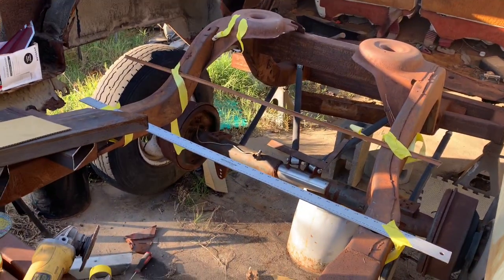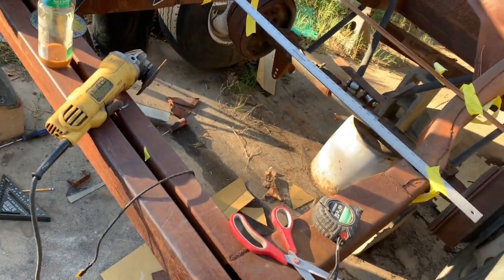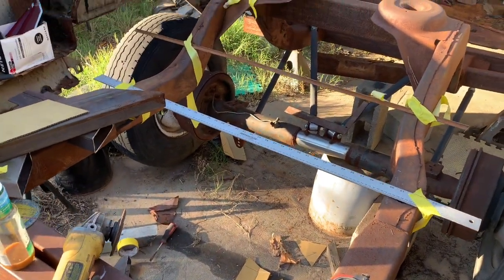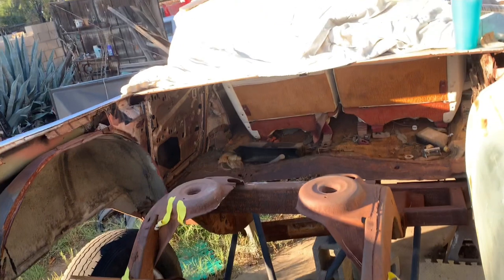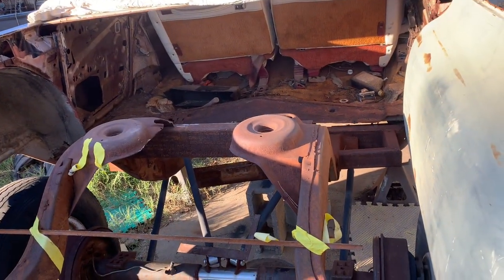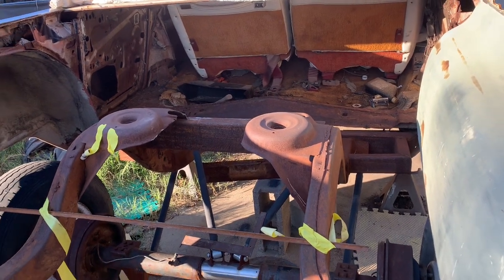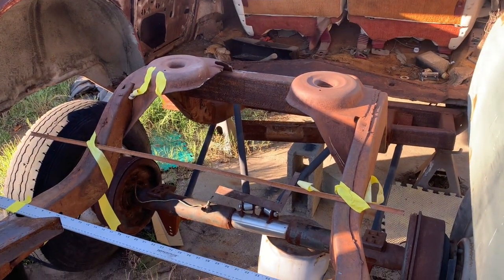So there's the back of the frame as it exists now. I already made it pretty stiff. It's got 2x4s in it. It's fully welded. I'm putting some torque boxes in the front there to give it some more strength. It's got some 4x4, goes up, connects to that 2x5 up in front. It's all 120 wall. It's all good metal.